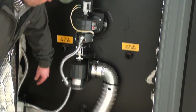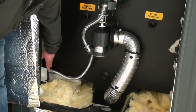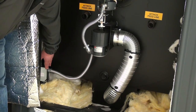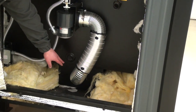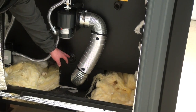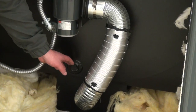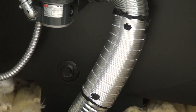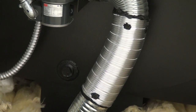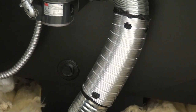You've got your electrical components back here. We can put an outlet and a switch to shut on and off your pumps. In the center bottom of the stove we also have a boiler drain — you can install a ball valve to fit a hose on it. So if you ever want to drain the system water, if you're leaving on vacation and not going to run it in the winter, you can drain the water and blow the system out.